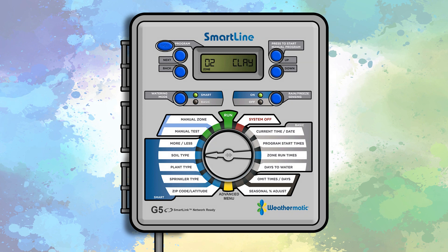After the soil type has been set, press the back button. The screen will read soil type. Press the up button so that the display reads slope, then press the next button. This menu lets you set the slope of the landscape for each zone. Use the up and down buttons to set the slope in degrees and the next button to advance through the zones.